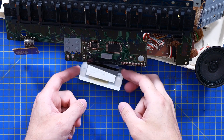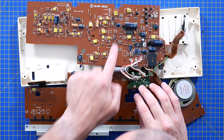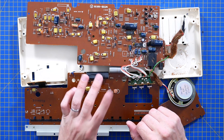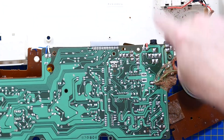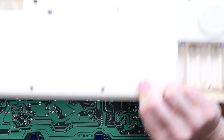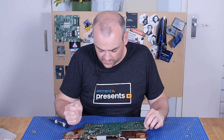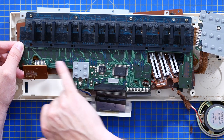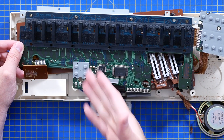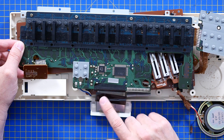Here is the screen, which has got a nice little Epson sticker on it. Here we have all the traces for the passives and two ICs — I suspect they are analog components, probably amplifiers. There is a really chintzy little foldy metal bit which I bet lined up with that hole marked 'P' — maybe that's program. Maybe you could update the ROMs on board from the external connector down here if you held down that button. And then on this main board which handles all of the IO, you can see all of the pads from all the buttons, each of the individual keys — even the black keys are still on here. This NEC IC appears to be handling all the IO, including driving the display.